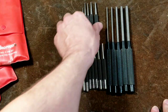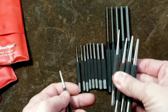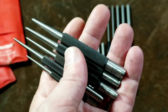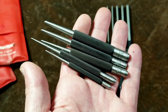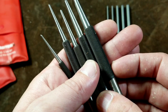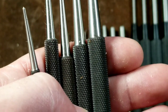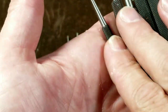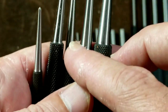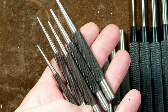Let's start off with the center punches. These are all pretty nice. One of the big things about Starretts is that they have a real fine finish. Being a manufacturer that makes a lot of machinist tools, that's one of the things you can expect — for them to look pretty darn nice. One thing to mention is that Starrett, like many other manufacturers, tries to save money. This five-piece set only uses three different rod sizes, and the three sizes in the middle are just turned down to different diameters. Even though the set was pretty cheap, I thought that was pretty cheesy.